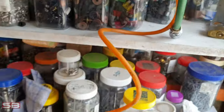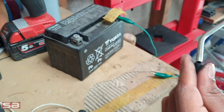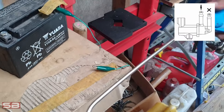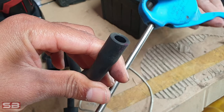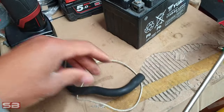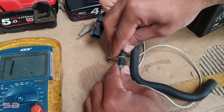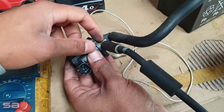So we'll take a line from here, run through that hose and connect it to port A on the solenoid. Now we'll blow air and there's no air leaking out from here — it built up enough pressure that the line actually just popped off. So that confirms there's no leakage between port A and port B.